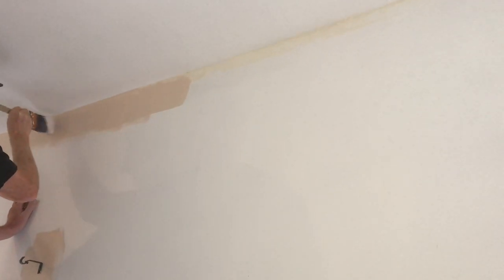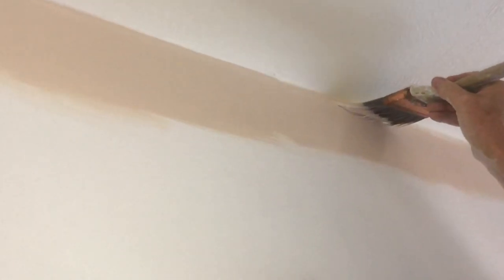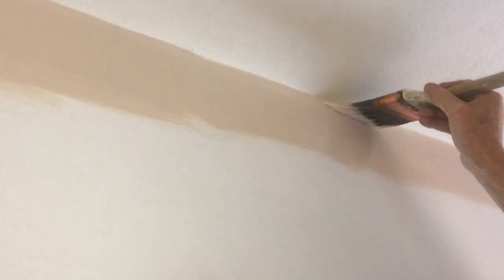Sometimes that drywall edge will move a little, and that's where the skill comes in — drywall only has the illusion of being flat, and the drywall joints will be a little higher than the rest of the wall. Each time you move the ladder, make sure you take the paint bucket off; if you don't, you're guaranteed to drop it. You can see how you can use the tip of the brush to follow that line and keep everything nice and straight. Sometimes you'll want to move the paint roller to the side to get the texture all the way to the ceiling.